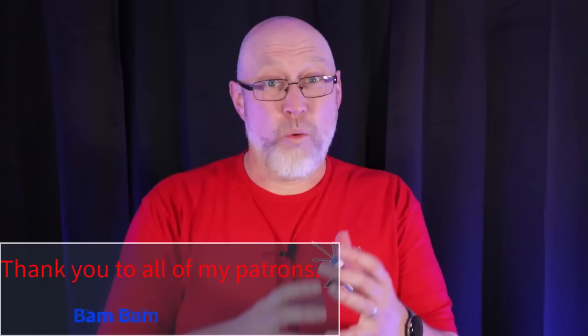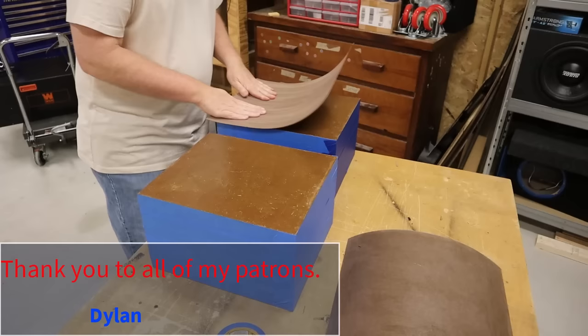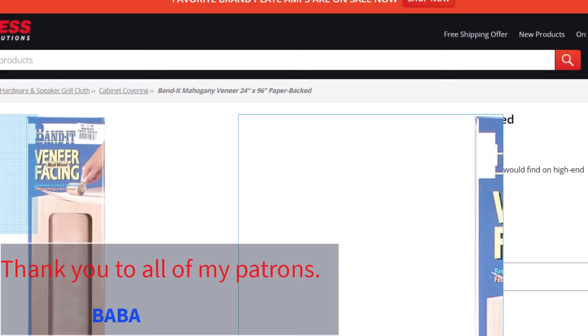One of my favorite things to do for home speakers is to cover the MDF with a hardwood veneer and then apply stain to that veneer. The downside is that hardwood veneer and things like fancy vinyls can be really expensive and totally negate the cost savings of using MDF. Also, MDF doesn't really work well in wet and humid conditions — if you get MDF wet, it's going to swell up and ruin your enclosure. So whatever you do, don't get it wet.